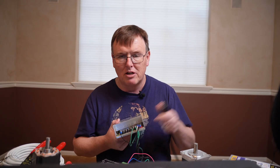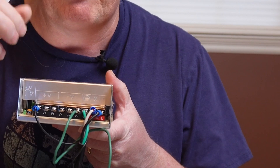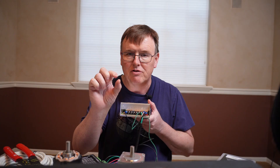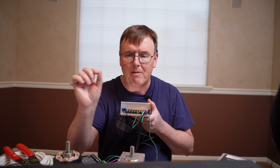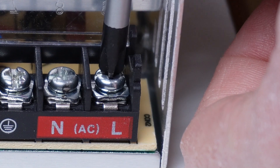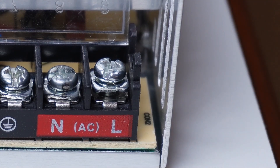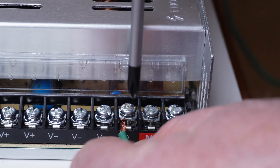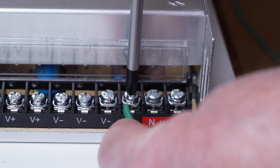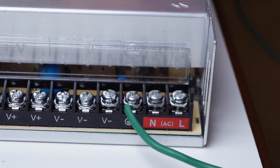As long as you keep this thing unplugged, you should be safe with these wires. Then it's just a matter of hooking the right spots. You can loosen the screw and take that stripped wire — I would have no more than about a quarter of an inch of stripped wire. Since it's braided I like to twist it a little bit, then tuck it between the metal plates. Loosen the screw and one metal plate will go up with it, leaving a secondary plate below. Slip the wire on the left-hand side of the screw so that when you tighten it down, it helps pull the wire around — putting it on the right side could push the wire out and give you a poor connection.